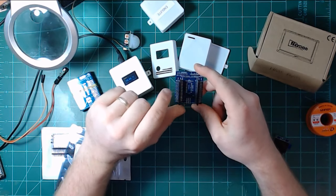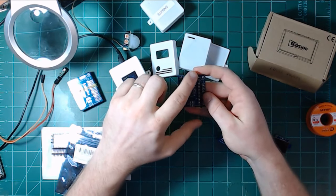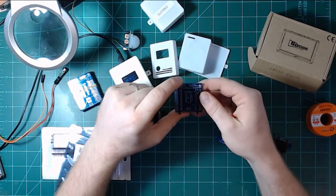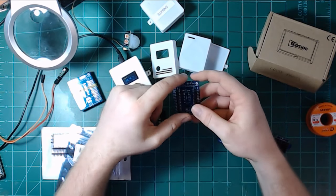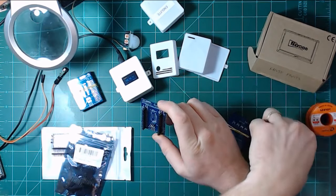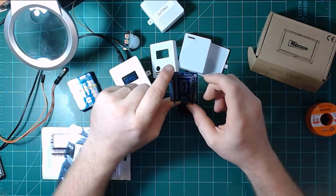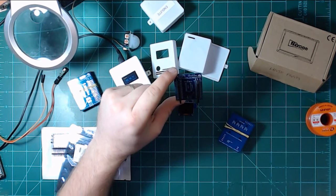Other changes involved different pin layouts for the external connectors. I was using GPIO pins on the NodeMCU that aren't really meant for external use. I started using this board with ESPEasy, so I wanted to switch to I²C sensors and OLED screens. I was using the wrong I²C pins for clock and data, so I wanted to make sure I was using D1 and D2 — the standard I²C pin set.